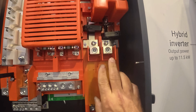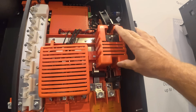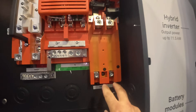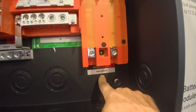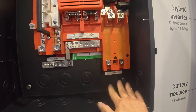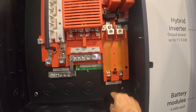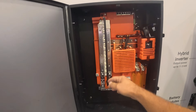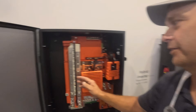200-amp service comes in here, and this is your automatic transfer switch — your disconnect for when the power goes out. And then down here, this is new: it has 125-amp non-backed-up loads. So if you want a breaker panel that you don't want battery-backed up, you can wire it up here. Otherwise your 200-amp service will go right out to your normal breaker panel, and right here is the bus where you plug in your breakers.